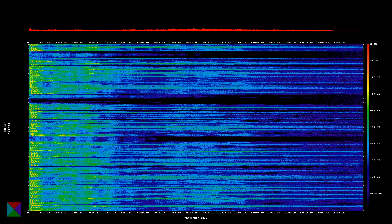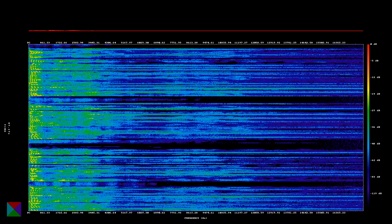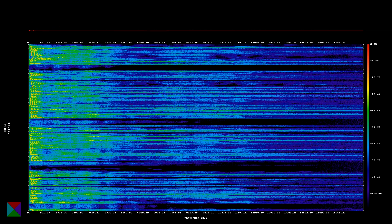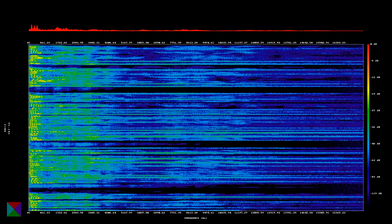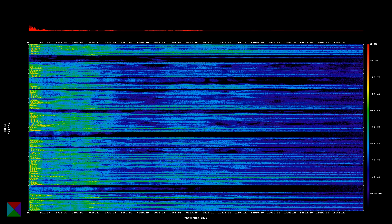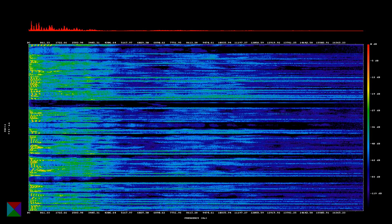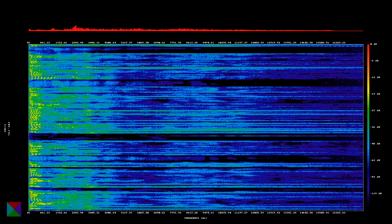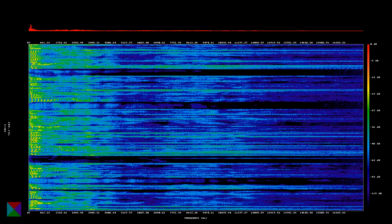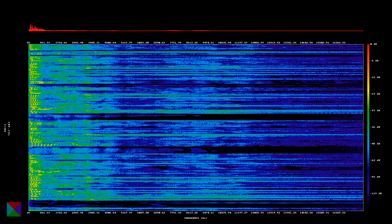One of the biggest issues with my RTL-SDR setup was squelch — that is, the difference between what is a legitimate transmission and what is noise. Set it too high and you hear nothing. Set it too low and you hear everything, including background noise. Since the VHF or 2m noise levels are quite high at my location, or QTH, I normally have the squelch completely closed. This is fine if you're normally using a strong repeater, but if you're attempting to receive a weak handheld, that's never going to work.